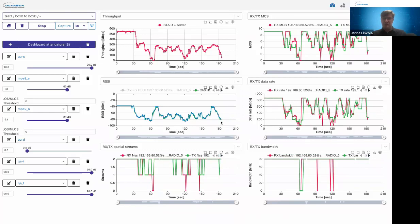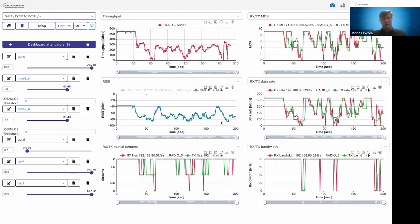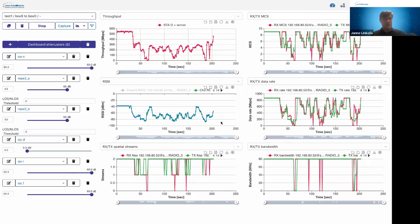We've taken into account the measurement instrument, as well as the instruments emitting the signal here, so that we end up with just the path loss being the thing that was measured. And so in this way, this becomes independent of the measurement device, as well as of the access points being used. We end up with the path loss, and then we can apply this path loss profile to basically any device under test. And if we use other stations for the test, then we would have to calibrate it a little bit, but it's a relatively simple calibration.